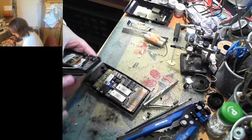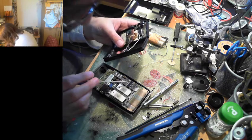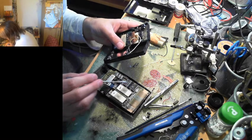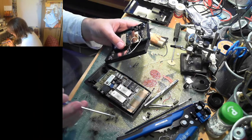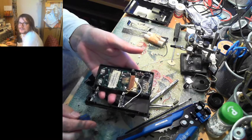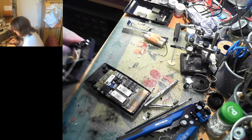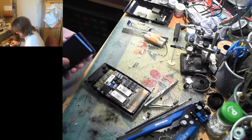Yes, ITT 1705. ITT, yeah, these are a different variant, but they're going to be display drivers, and they go up to the display multiplexer. So yeah, they're display multiplexers, and probably because there's a lot more elements in that. But yeah, there's a look inside the Sinclair one. And it even has a very similar chipset to the Royal Digital. This one has one manufactured by MOS Semiconductor.